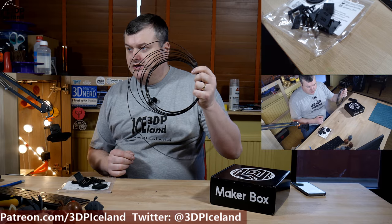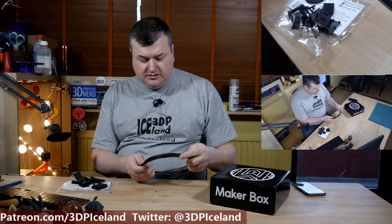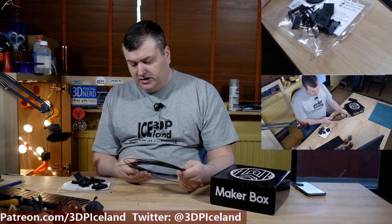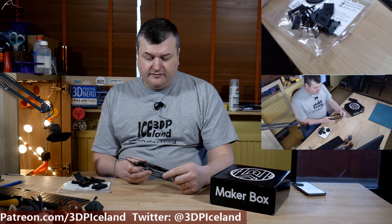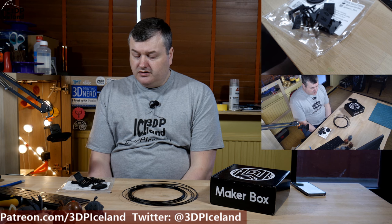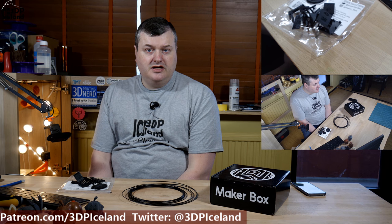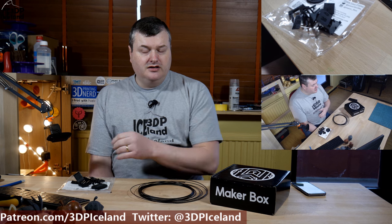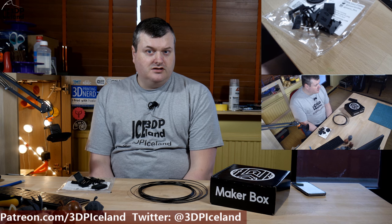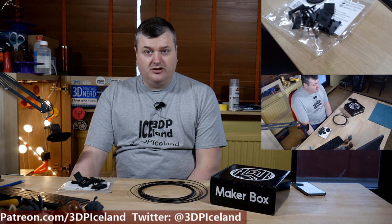As you can see on the table I have quite a lot of this filament left. I wanted to keep some and use it if I need to make strong, stiff parts. I printed out maybe half of it in test prints and want to keep the rest for myself. Overall I was quite happy with this filament — it has great strength and is very stiff. The only downside is the polypropylene aspect: you have to use packaging tape on the bed to get it to stick, and it's a pain to remove the remaining adhesive from the PI sheet. You have to use acetone, and with the tape I had it was quite a pain to remove.